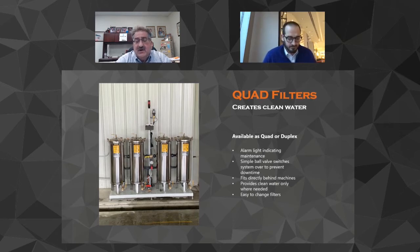Actually, it is more abrasive, of course, because it's crushed garnet. It comes out easier than the stone dust. If your shops were 100% garnet, it would be easier and you would have cleaner water through the course because the garnet comes out. When you look at, like, again, that big gray dumbbell system, that thing is designed to put on a water jet table and simply remove, and it removes 99.9% of the garnet that you put in. So when you put in those 80-pound bags of garnet, we take out an 80-pound bag. Otherwise, you start filling the bottom of the machine.